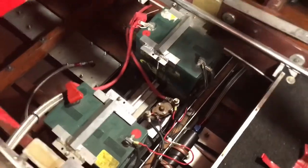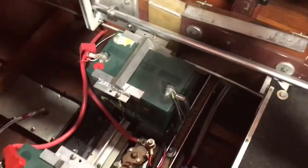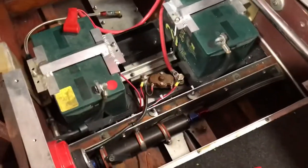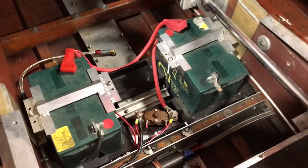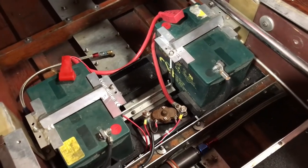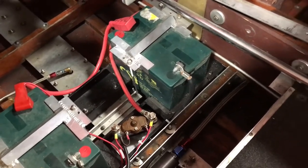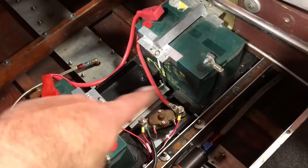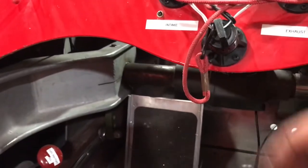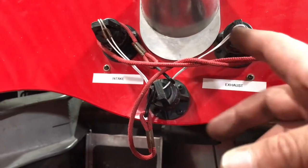We're not going to mess with that much — that's all pretty much going to stay the same. The only thing I'm going to do is change the power supply for the main battery relay. In the basic description of this system, what makes it somewhat complicated is it's a 24-volt main system but we also have some 12-volt components. So we basically have two buses: 24 and 12. I do all the splitting basically right here in the battery area, run it up through some breakers on the side, and then up underneath the panel I have a couple of bus bars — one is 12, one is 24, and then one for all the grounds.